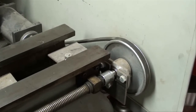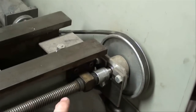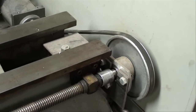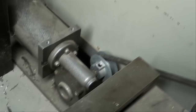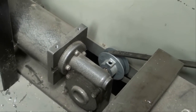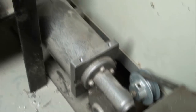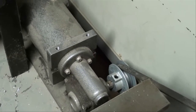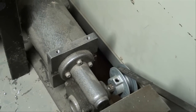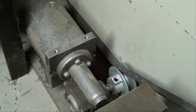I've taken the belt guard off temporarily so I can show you this — I am aware of safety. I've got a pulley mounted on the end of the lead screw, so I'm driving the lead screw from the tailstock end rather than from the headstock end. Behind the bed we have a geared head motor with a pulley on it and then the belt. This is a very high quality motor and it came off of an NCG Chemtron MIG welder.